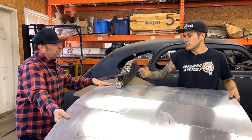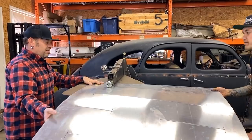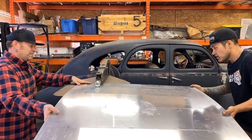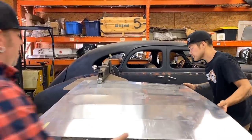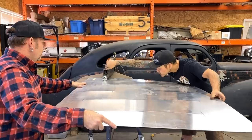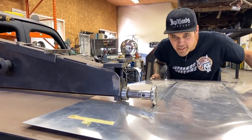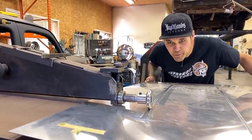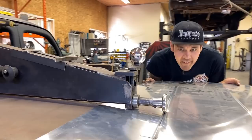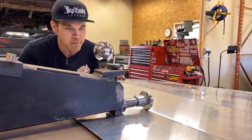You try and do the same amount — once it touches down I usually do about one and a half to two turns. It won't matter quite as much because it has a depth stop — those dies are their own depth stop. Key thing is just hold that edge up a little bit. This bead roller is just the cheap bead roller but we built a new frame for it so it's got a deeper throat, put a garage sale motor on it. It's worked fine for the last seven years. I've never even tried a manual bead roller — I bought one and was like, this is not going to work.